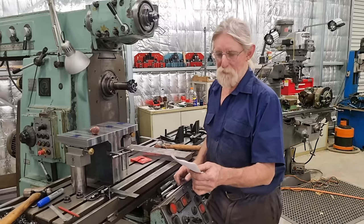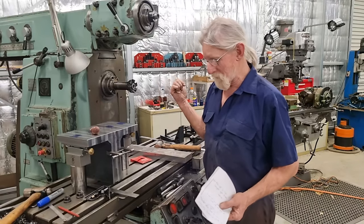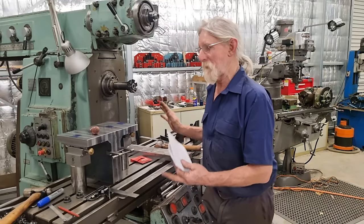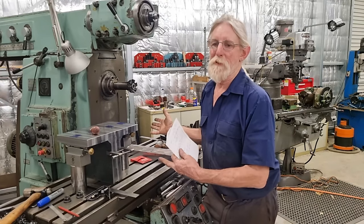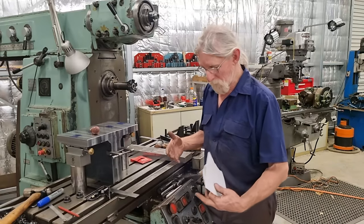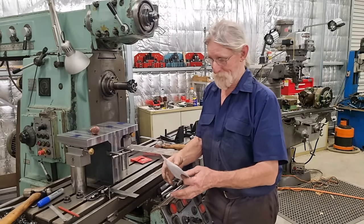Feed delay, I think I've already explained that, which I have to work out. That's to do with the switches. So when I turn the feed off, the feed instantly stops, but the feed motor carries on for another few seconds, and until that stops, it prevents me from doing any other movement or even shutting off the spindle on the machine.